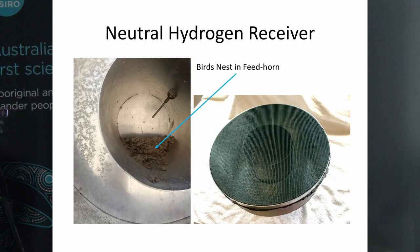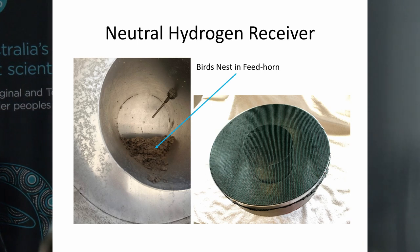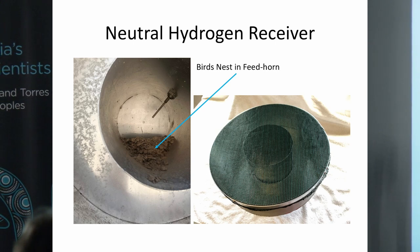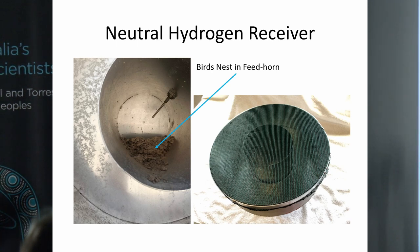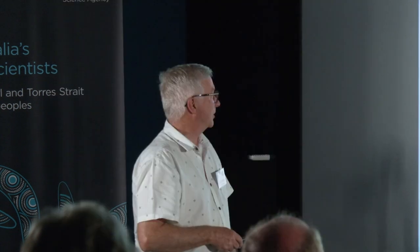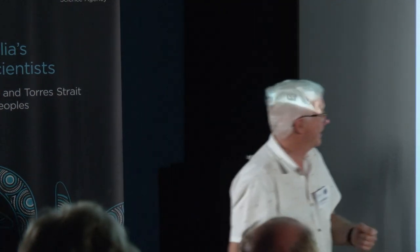Another drama was discovered by Phil Costigan during a routine maintenance program: some local bird species at Heathcote had decided to nest inside the waveguide — about 400 grams of mud. The clay soil at Heathcote is highly mineralised, so this would have detuned the resonator quite significantly, plus the birds were going in and out. After experiments, good old garden shade cloth proved acceptable and stopped the birds from nesting in there.